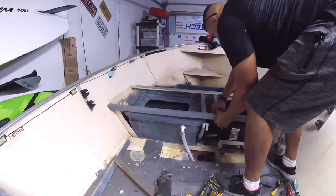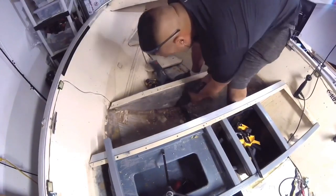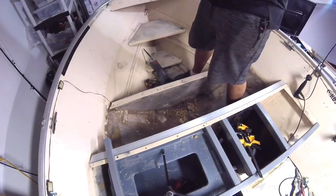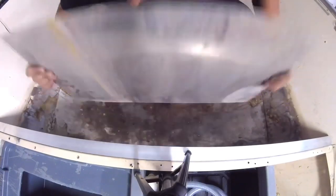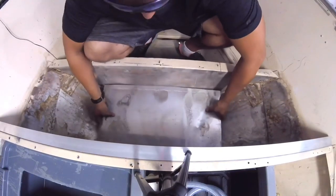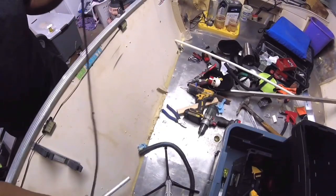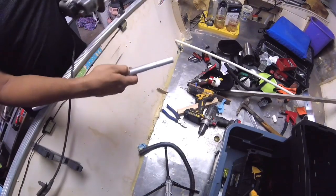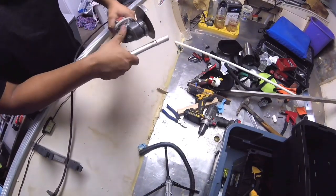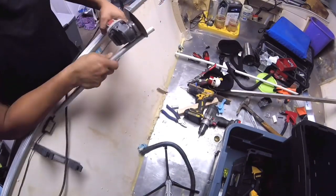At this point in my boat-building venture, I've done away with most framing styles — I've stuck with Gen 5 and Gen 3.2 Retro, those are the only two I use now. This frame is actually a hybrid of both. We sawed out that little bootleg pipe and we're going to put in an actual subfloor, because the rest of the boat has a subfloor and it makes no sense for that part not to — so the water can channel out all the way to the bilge.